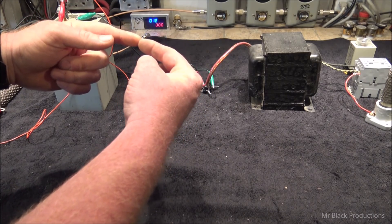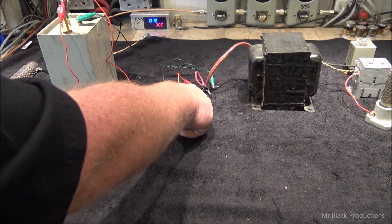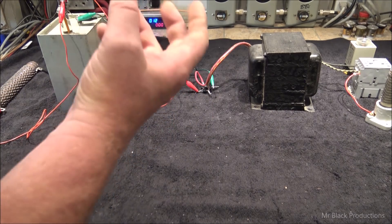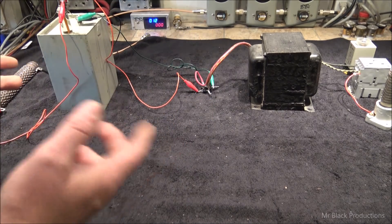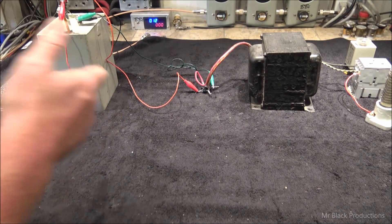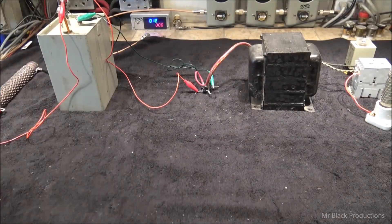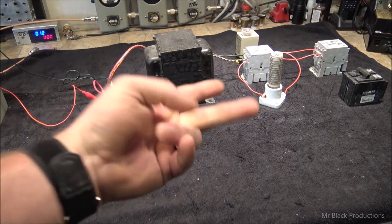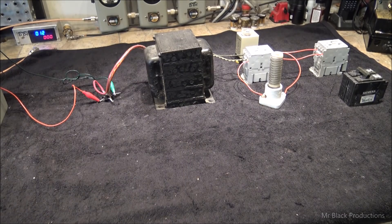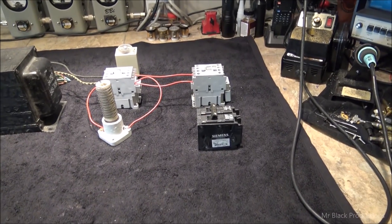Without the soft start circuit, you might as well take the positive and negative leads of the diodes and short them together — just for half a nanosecond — but it's still a dead short, which can degrade the diode's ability to do its job, and it's going to eventually cause it to leak, or in some instances just blow up. These will open up and then you will have a dead short — the output of your transformer will dead short through the diodes. It'll blow up the breaker, it'll blow up the fuse.